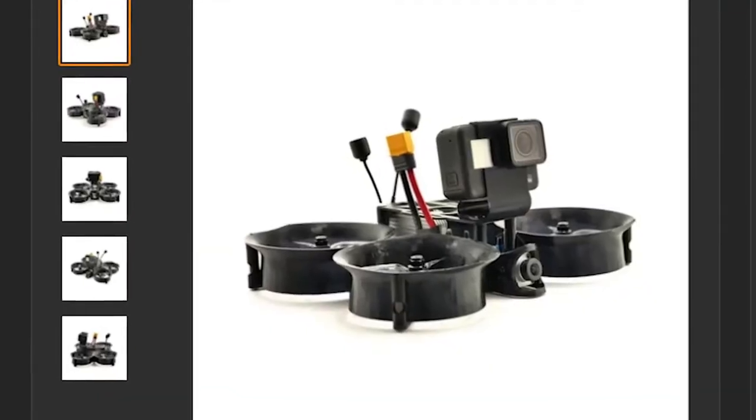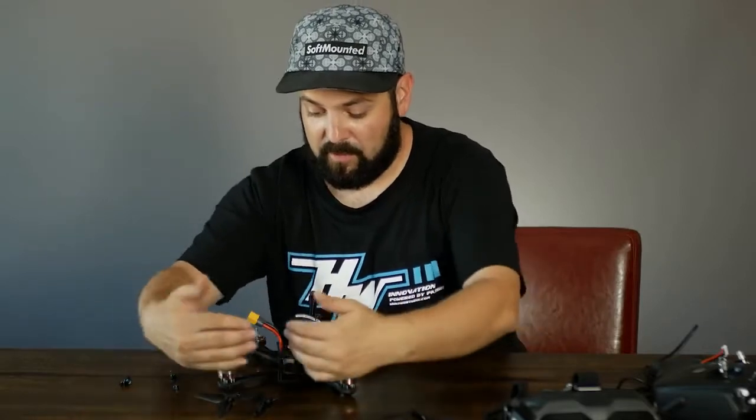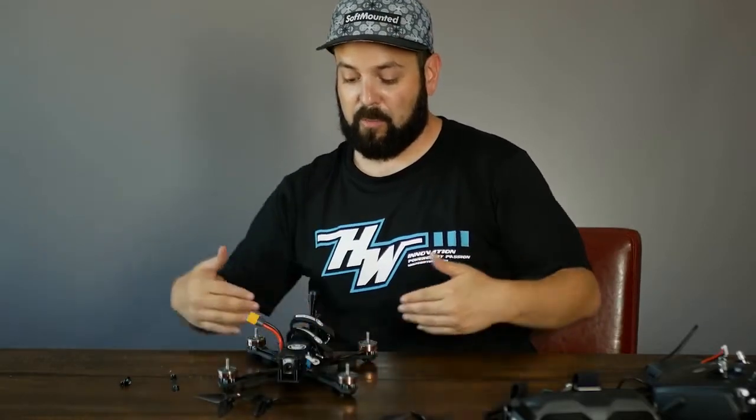So the way that most drones are set up is for the props to spin inward, where the front 2 props spin toward the camera, the back 2 props spin towards the antennas. You can think of the drone as giving you a hug with them props. But in some specific builds we've found there's an advantage to having it go the other way. So our Cinewhoop build is a props out build. So it's swimming. Yeah, just keep swimming. The front motors go in towards the camera. The back motors go in towards the butt.